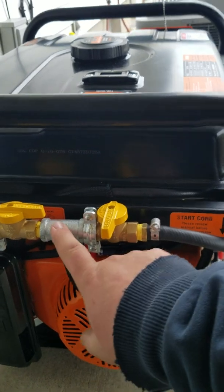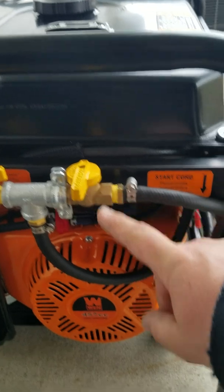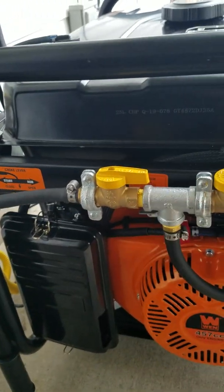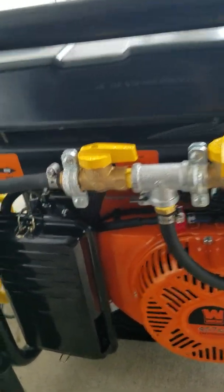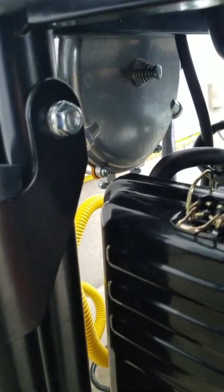This is your air/gas fuel selector. This switch is off, which goes to the propane regulator. This switch is on, which goes to the natural gas regulator — I'm just gonna leave this in the on position at all times. Underneath here, on the backside of this regulator, you see this little button with the spring on it — that is the primer for the natural gas. The choke for the carburetor stays in the run position at all times; there's no need to even move it.